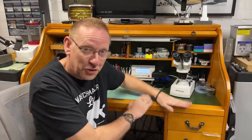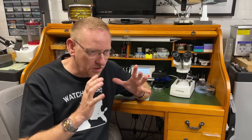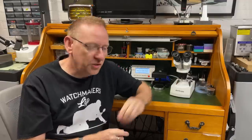I've now taken that out, and so far, touch wood, it hasn't done it. It still might. That's the problem. The gears feel really, really free. And obviously, because it's quite random, it's not happening at a specific time every time within an hour. So I'm hoping it is just that little speck of rust dragging it somehow, or stopping it. It doesn't take much to stop a watch. I did a video called that, I think. So there we go. That's it.